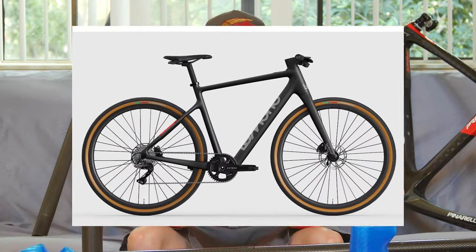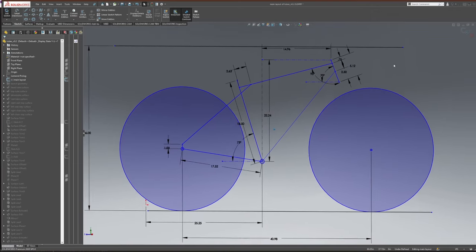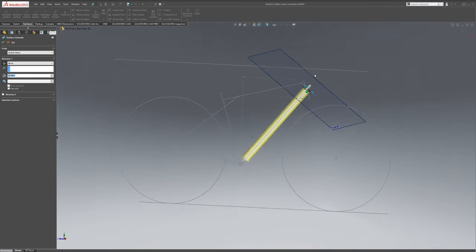That's okay, because for a while now I've also kind of wanted just an easy commuter type bicycle. So that's what I'm going for, and that will drive the geometry and the build out of this bike. My first step was to lay out the frame geometry, starting with a 2D sketch of the basic dimensions, and from that planes can be projected and a 3D model of the various tubes can start to take shape.